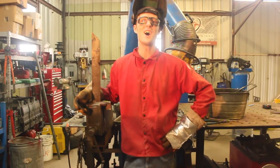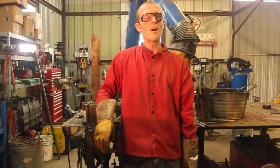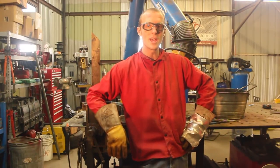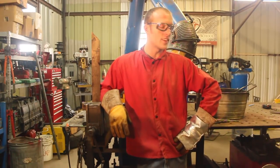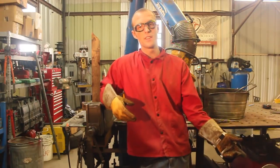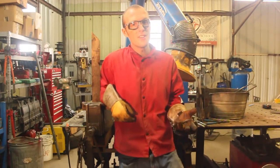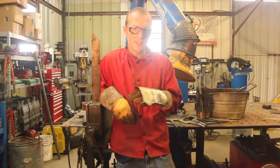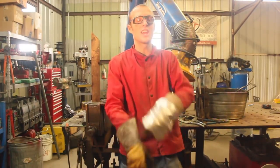That was a lot better than I thought it would be, to be brutally honest. In the past I wondered why anyone would ever want to do pulse stick welding, but my mind is made up — this is actually quite impressive. Coming out here this morning with zero pulse stick experience, I was able to use settings from my buddy Pete, get the machine set up quickly, and just be in business. It just plain works — it's not harder than regular stick welding, and in a lot of ways it's easier. With 6010 and 6011, no longer do you need any motion — just set it to about one and a half Hz and do a straight drag and you get really pretty little dimes.